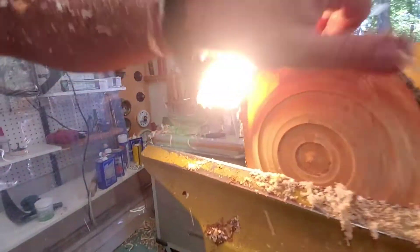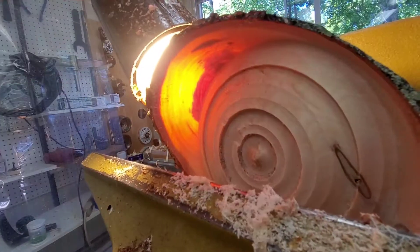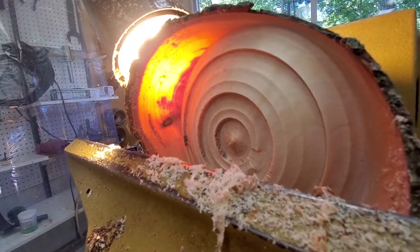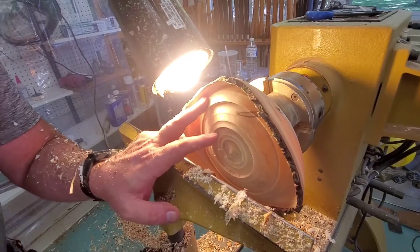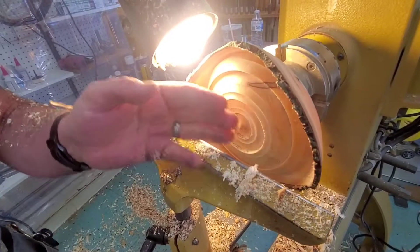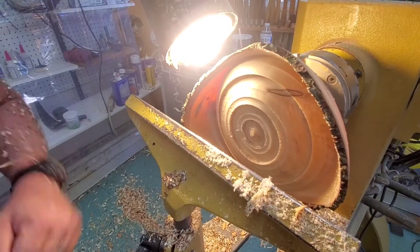Let's see what we got. Wow. Yeah, and you can see that's an even shade, so my thickness is pretty even. And that's what that light does. The rest of this is down beneath the bark, so this is just a regular bowl at this point. I'd hollow it the normal way - I'd actually start from the center and start hollowing out to the edge, as opposed to punching down in towards my support. And that's it.